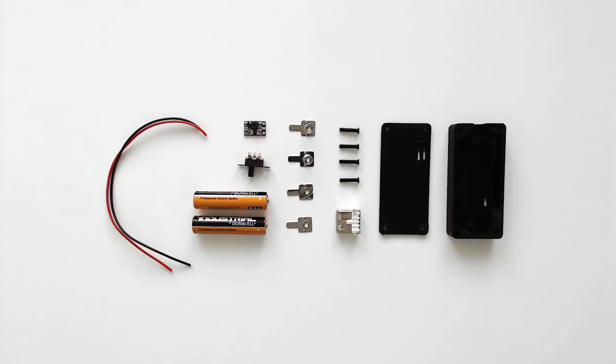It consists of the following: 2 AAA batteries, AAA battery springs and contacts, you can find these on eBay, the innards from the USB female port, 3D printed parts, a switch, a 3.7V to 5V step-up converter. The batteries only output 3V, but this seems to work fine. Some thin wires and 4 M2.5 8mm screws.